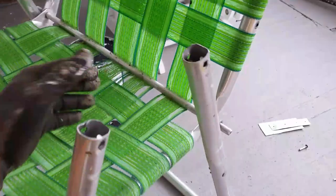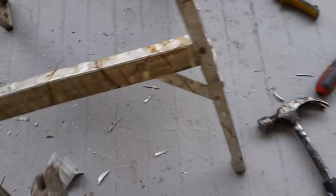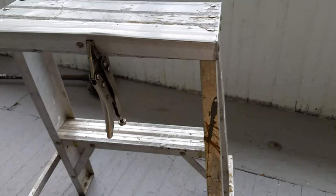You're asking what am I using - well, this old chair I was gonna throw away. It's rotted, it's not safe to sit in, see it's coming apart. And I got to looking at this thing and wouldn't you know - looky there, we got our angle that we need, and it's aluminum! So I drilled out a couple of holes here, got a couple of these pieces out. These rivets - I drilled them out and I got one over here I can use on this side. I had to take my snips and kind of cut the ends off and measure it, but how cool is that? I've got some holes here made, I'm gonna run my first holes here and put my rivets in, go on this side and throw some holes and rivets in there, and that'll hold it really good.